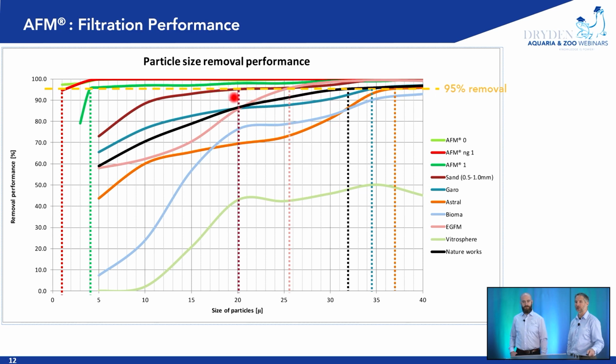And the majority of the time, your sand medias, and this is all brand new media, whether it's glass or sand, might outperform the standard glass medias on the market. The bottom line is the very rounded glass beads will always have the worst performance. If you go back to our reference of session number 2, where we talk a little bit about how filtration works, that explains that poor performance very nicely.